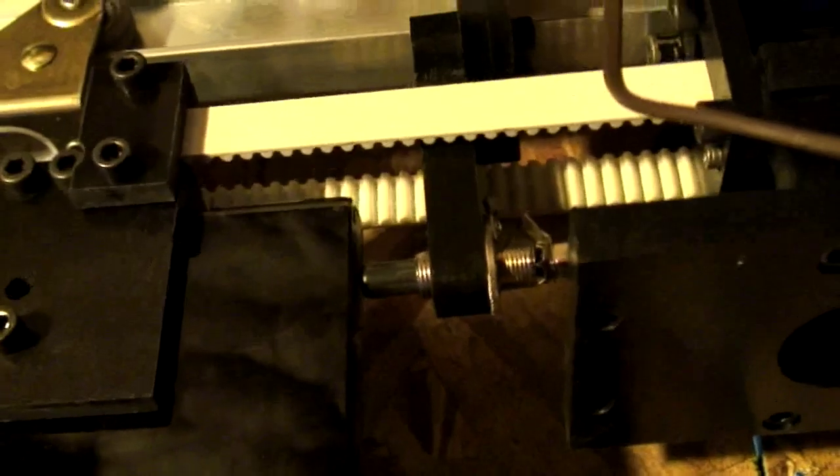There's adjusting the limit switch that sets how far the door is going to go inside the pocket. That switch just gets pressed one time when you power up the system, and then the door knows where it's at from there after.